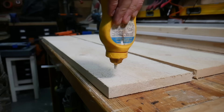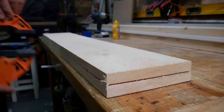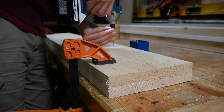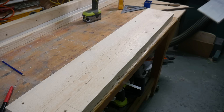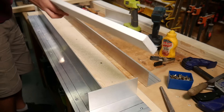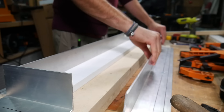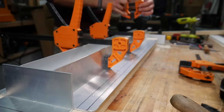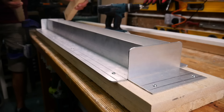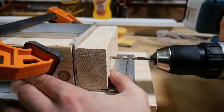The scaffold boards are going to be the base of the mould, and we're doubling these up to make sure it's super sturdy. Using aluminium angle means not only is it super tough, but it also means that those inside faces won't have any screw holes for the plastic to fill. We're reinforcing the aluminium angle with some standard 2x3s, and we're screwing everything together instead of gluing, just in case the beam gets stuck and we need to unscrew it to get out.